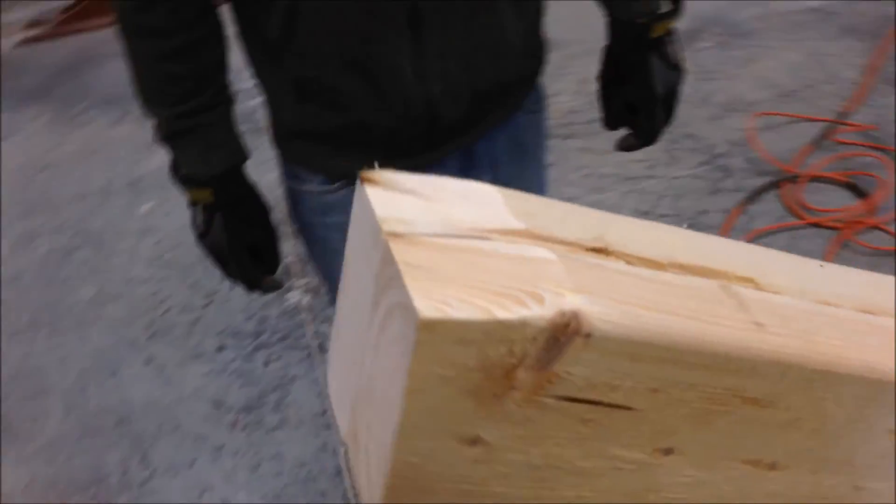There's the seat for the bottom end of our rafter. That angle right there will sit flush with the top plate of our lower wall.